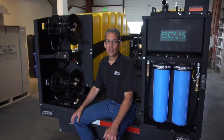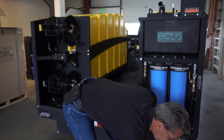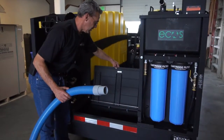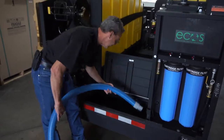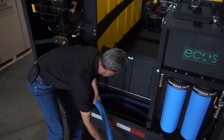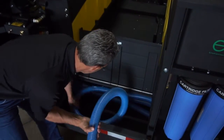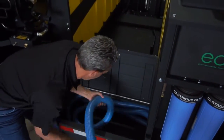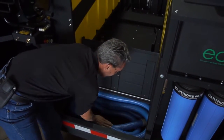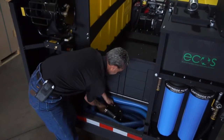When the Eco 7000 is unpacked, there are several components that have to be installed onto the unit. In the box, there is a 50-foot blue 2-inch vacuum hose that stores beneath the back of the unit in a compartment. In order to get this hose completely in the compartment, it must be laced in and twisted as it is installed as tight as possible in order to fit all of the hose into the compartment. Once the hose is in the compartment, the suction scupper that goes to the end of the hose can also be installed and stored in this compartment.